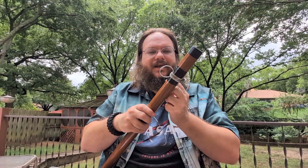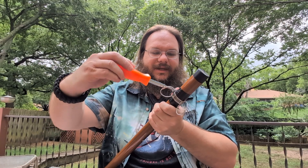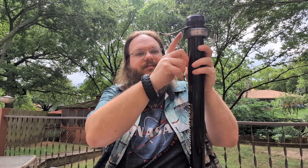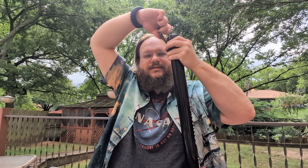There we go — I don't think that is going to go anywhere. Since I doubled up or tripled up on the tape, it's eating into the tape as I'm clamping it tighter instead of into the core of the mast itself. To double check: I can move that last sleeve in and out and it's not clamped or binding. On the bottom of this DX Commander, I have kind of the same clamp and hose system as the top. However, I got this tree tie, which is also wrapped around the hose clamp a couple of times so it's secured — you can't pull it out because it tightens on itself.